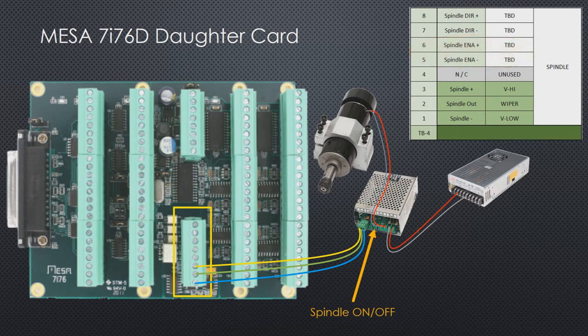There are also a couple of other pins for spindle direction. You could drive a double-pole double-throw relay, cut the wires to your spindle, hook it up to that relay, and reverse the spindle. For little spindles I don't really see a need for it, but if you have a bigger machine doing tapping and want to reverse it, it's possibly useful — I've never needed to use that function though.